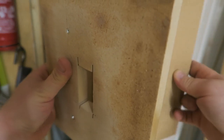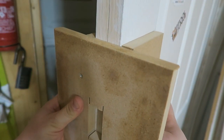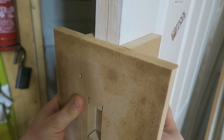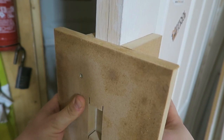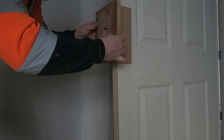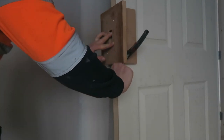I fit the second cheek in situ on the door. This gives me an exact placement for it instead of measuring across and risking getting it off by a millimetre and ruining the jig — this way is much easier and very accurate. Find your spindle height, clamp it in place, set your router depth, and you just become a fully fledged speed carpenter. Look at you go!